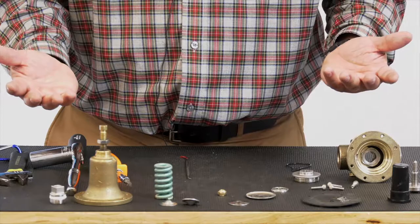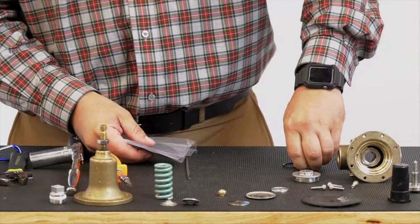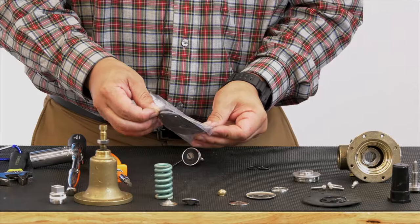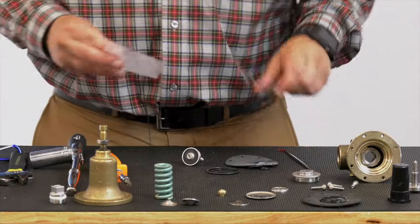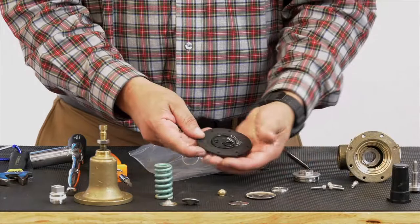And that's basically all your O-ring. So now reassembling our new stem assembly and our disc guide here. So we'll use our repair kit here. Again, the universal repair kit is going to have a couple of extra O-rings, but those may go to your CRL. So if you're not sure if you have a CRL or CRL 60, get the universal kit. You'll have a couple of O-rings, but as you can see, I have them set here of the O-rings that I just removed.